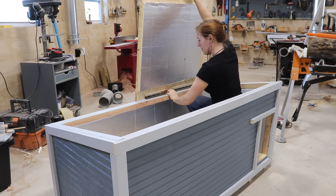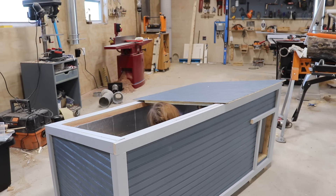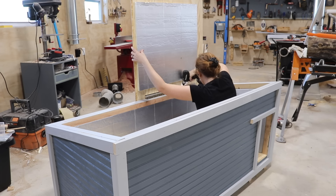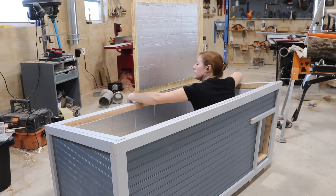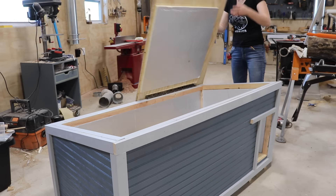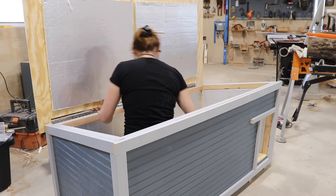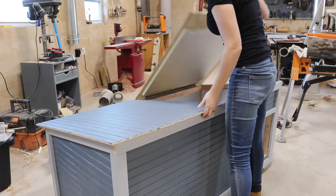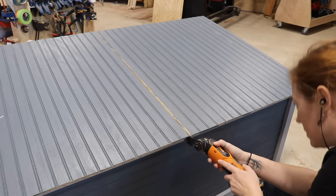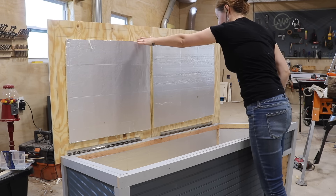By this time the insulation was well past stuck in place, so I first attached a portion of piano hinge to the underside of the roof panel, then crawled inside the house and attached it to the body. I should have seen it coming, but the door actually has a built-in stop with the overhang on the back end — so that works out conveniently. After getting one secured I repeated on the second, using the tongue-and-groove feature of the beadboard to make the seam in the middle disappear. The only issue was that trying to lift one panel without the other caused them to run into each other. To fix this I grabbed my multi-tool and notched out a small portion in the back so one panel could clear the other — and now it's working correctly.